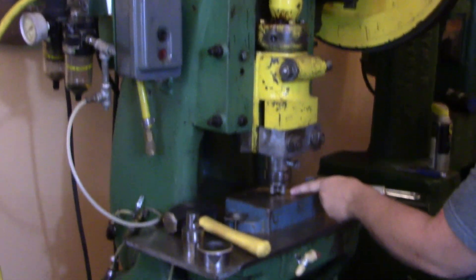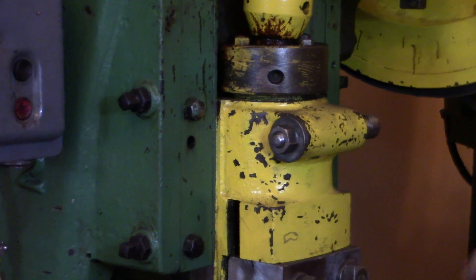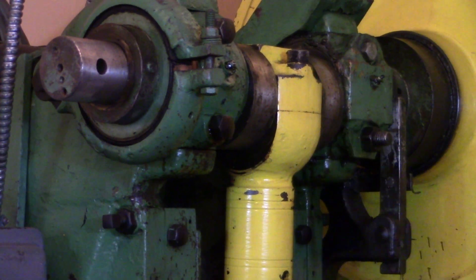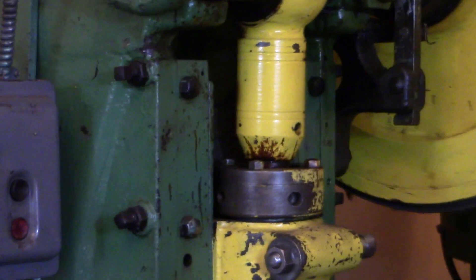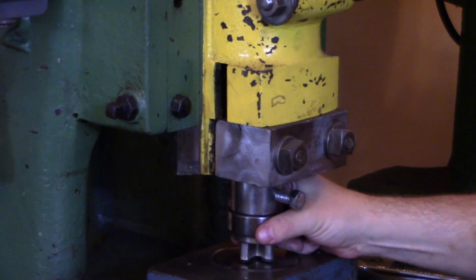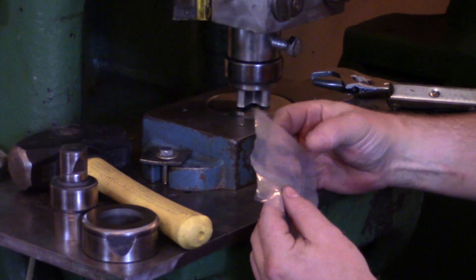Now as it's approaching the base here, I can see that it's pretty close. So what I'm going to do is actually lift it up. There's an adjustment here in the screw that allows me to adjust the depth. And what I'm looking for is bottom dead center. I can just do this by eye on a nice small press like this. And bring it up a little more — I don't want any contact there yet. I get down there and I'm at bottom dead center. Not much movement there. So now what I'm after is getting that punch to plunge into that die. And what I have here is just a piece of plastic — together this is about six thousandths of an inch thick. And what I'm going to do is place that in here.